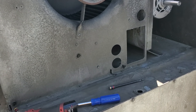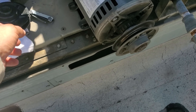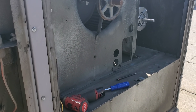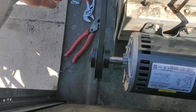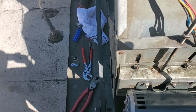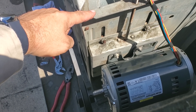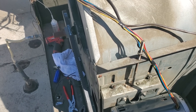Blower assembly's back in. It was kind of a chore, but we got it. Everything's kind of coming together. We're going to put the pulley on the new motor. What I do is I take the old one and I match up the opening to the new one and then we'll see where that gets us. See how the motor pulley is pitching in and it's just all out of whack. And that's because the blower assembly is just all out of whack. These Carriers are never — and this is even the reinforced bracket, the new reinforced bracket. So it's got to have something to do with that whole cavity caving in.